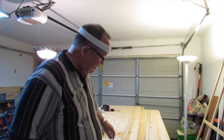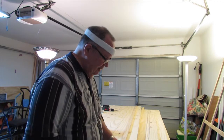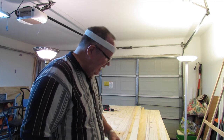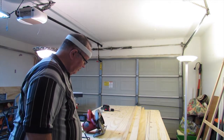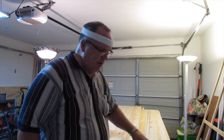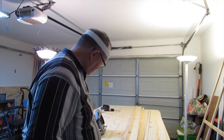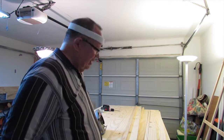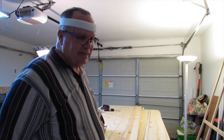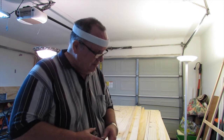Then I moved my strapping over again another 3.5 inches plus the width of my saw shoe, and ripped a smaller piece here on top. Then I took the smaller piece, I measured my shoe from the outside of my saw blade to the inside of my shoe, it's 3 3/4 inches. So I took that measurement